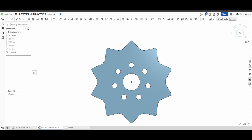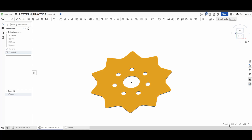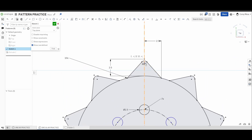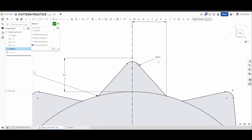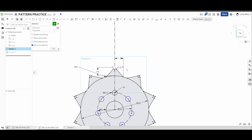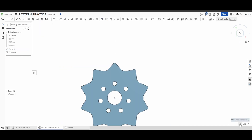To check our area, click the face — the area should be 341.269 square inches. One thing to be aware of: while working on this I noticed that this radius of 0.5 at some point changed to 0.25, which gave me wrong geometry. Make sure you verify all your specs so that when you find your area it matches what's expected.